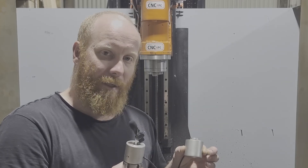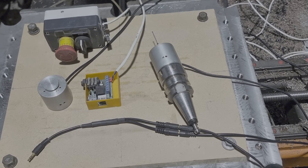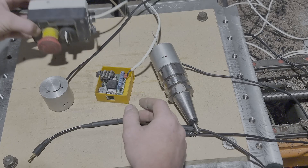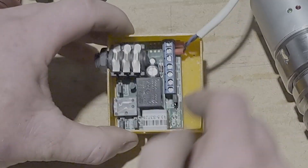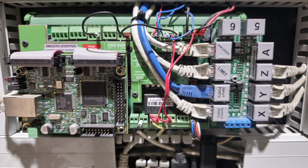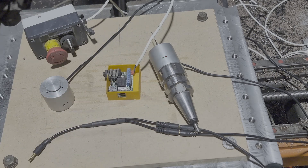So it just makes everything so much easier. We'll dive into how it's all wired and the control board I'm using this with. Here we have the main components of the setup. I've got my emergency stop, which actually gets wired into the main control board. It's pretty simple — you wire in both sides of your emergency stop switch into the board here. I connect a wire into this one here which goes back to the emergency stop on my actual C82 control board. Every time you press the emergency stop button, that sends the signal to the machine to do an emergency stop.